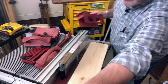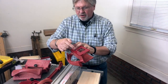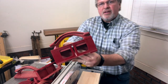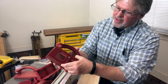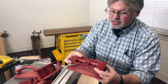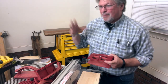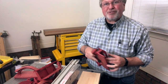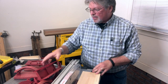They did change the fence straddler design — they used an off-the-shelf bolt now — and it doesn't work quite as well as the original. The 510 model has a hex-shaped bolt head that slides very nicely. If you wax these, they work much better; the one I have in my shop is waxed. By the way, this is my garage — I have a separate shop but it's quite a ways from here, so I'm setting tools up at home to get some things done.